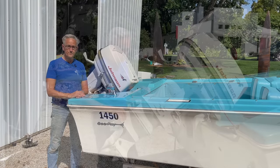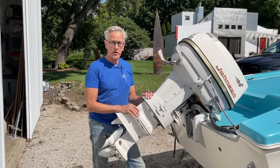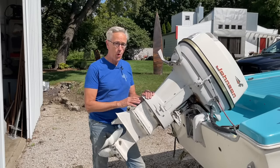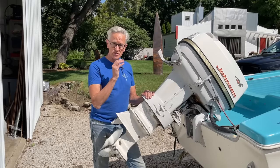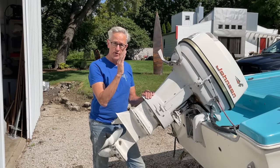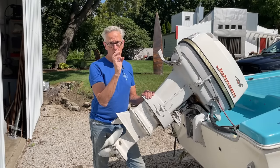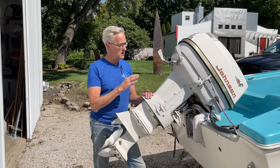While I was out at the wooden boat show, I was able to ask quite a few people that knew a lot more about outboard motors why I was having that fuel problem. Basically the answer is that this fuel pump, which was a rubber diaphragm, is driven by a cam in the motor that was probably worn down round and not egg-shaped like a cam should be. So therefore it wasn't moving enough.